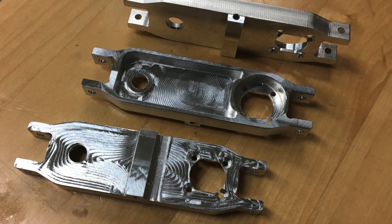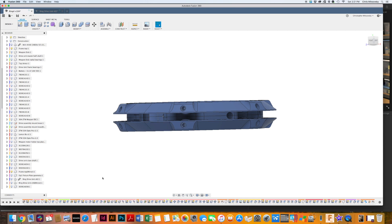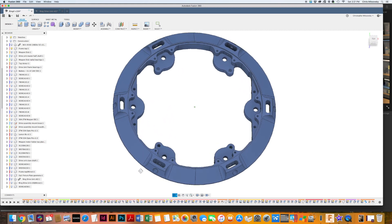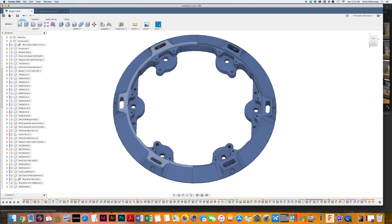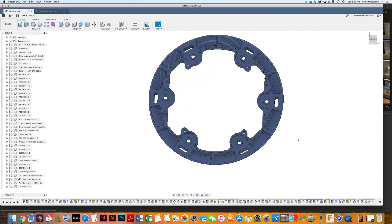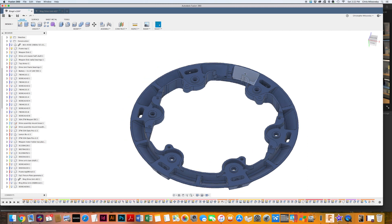Here's the frame of Q in CAD. The frame is made up of two identical halves — a top half and a bottom half. I knew I wanted to machine this from the beginning, so I was thinking about that when designing it. Most features can be accessed from the top or bottom during machining, since you're holding something in the X-Y plane and coming down in Z.